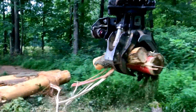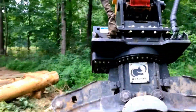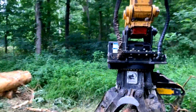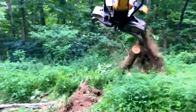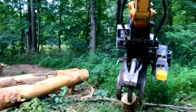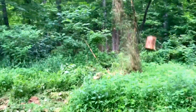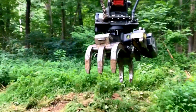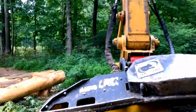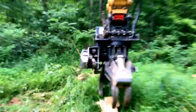But heavy duty is important. And I would think that them bridges could be 25 foot and lighten the beams up enough to where they don't weigh any more, and they'd still be fine at 25 foot. Now, the reason they're designed with the handrails and the rails on the side, like you seen in the last video, is so if you're skidding logs over, the log can ride up on them, or if you're trucking out of them, you can run a steer tire up there or hit an axle with it, and it'll slide up till you stop, back up, no harm, no foul.